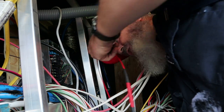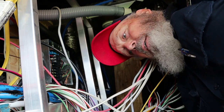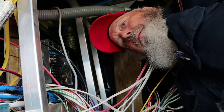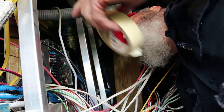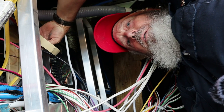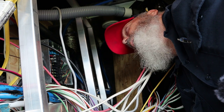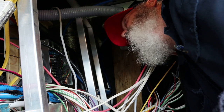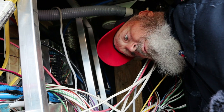We're good to go, we are good to proceed. Just got the new one opened up — it is the same configuration. Since it's the same manufacturer, same model number, it's just missing an electronic board here. I'm going to label the load wire and the shore cord because they're identical. The generator is orange covered wire, so we don't have to worry about it, but the others are black. So I'm going to label those just so there's no confusion at all.